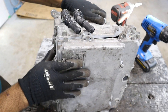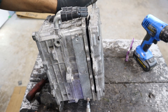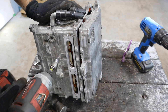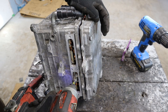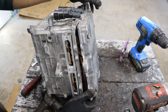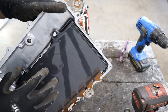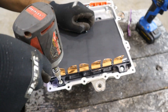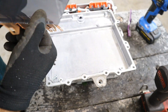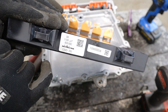I forgot to disconnect the capacitor, so I've got to open up this part. Inside of here we have the connections that go to the capacitor which is attached here. Now I should be able to take off this top, and you can see these are the connections that go to this giant capacitor. I'm going to remove the smoothing capacitor here — you can see it's 1100 microfarad at 600 volts DC.